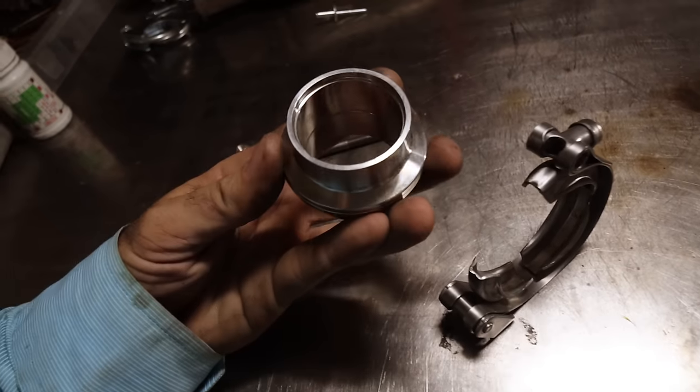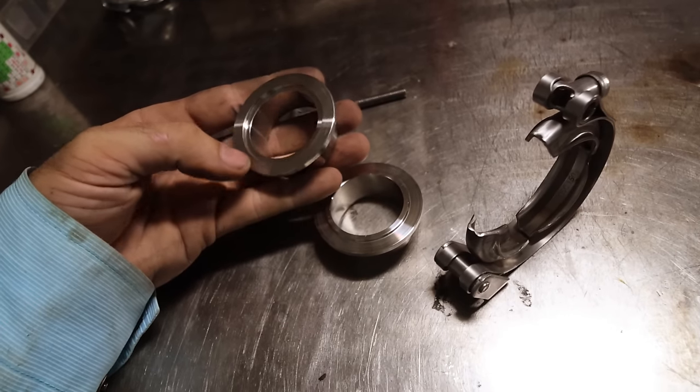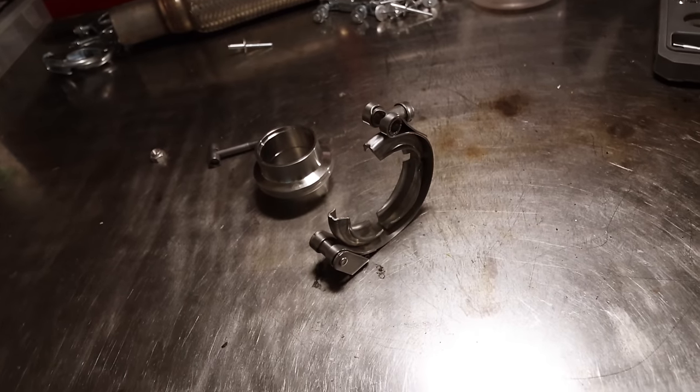You can see there's basically nothing to escape out of there. So you don't need to put any sealant in these. These are machined to a tight enough tolerance that they'll seal just by having those faces clamped together really tight. And that V-band clamp clamps them tight enough to do that. So what's the anatomy of Jenny's exhaust? We're going to do the slip joint up on that muffler because that's a really easy way of joining it at that muffler, and we've got enough overhang of the pipe going inside the other one so that we can do it without it leaking.